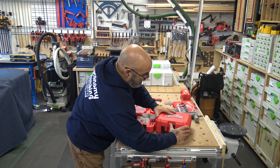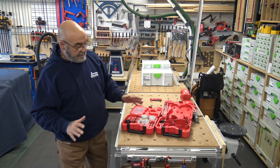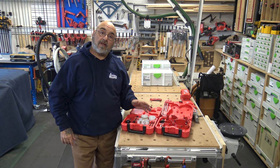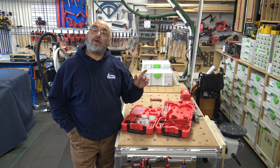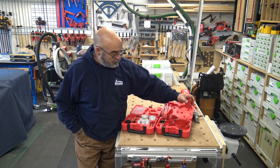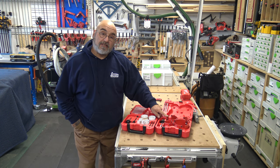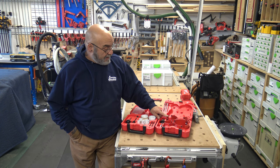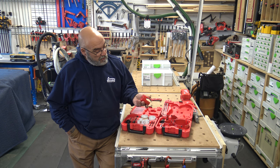These two sets here are our main go-to bit sets that we keep on our truck for drilling for our sewer and water pipes. This is a brand new set, never been used. It's their three-tooth carbide tip set — it starts at two and an eighth and goes up to four and five-eighths. This whole set is good for our one-and-a-half to four-inch PVC pipe.